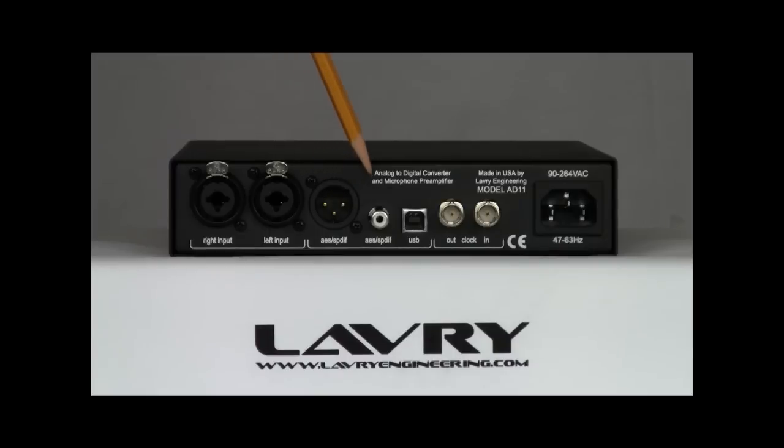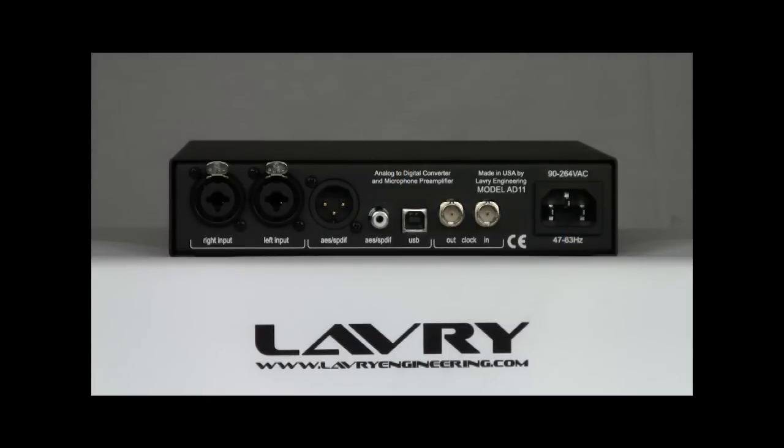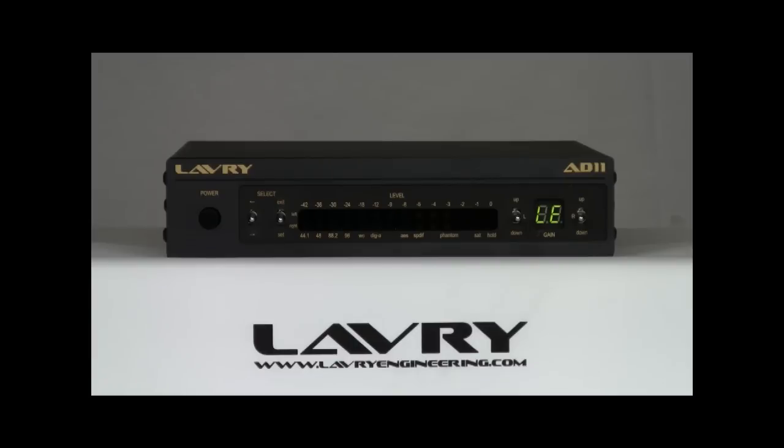There are three digital outputs: the XLR and RCA digital audio connectors that can output either pro or consumer formats, which we refer to as AES or SPDIF, and a USB output for direct connection to a Windows or Apple computer. The USB output utilizes the native USB drivers in both Windows and Apple operating systems, so you don't need to worry about driver updates. There are also BNC word clock inputs and outputs. The BNC input can also accept AES sync as well. Now to the front panel.